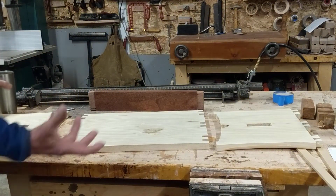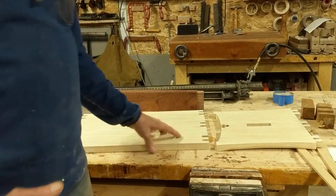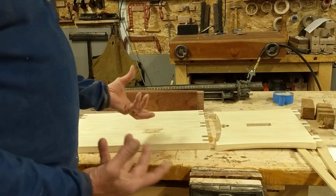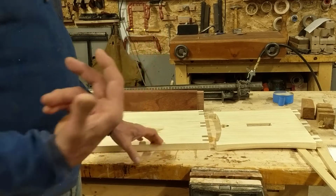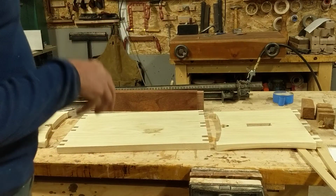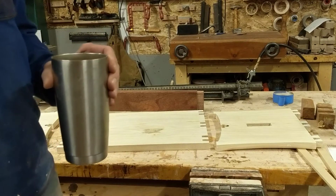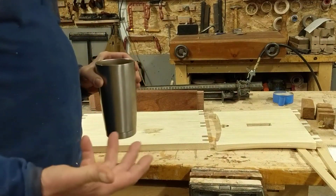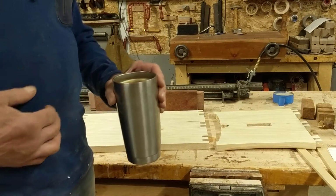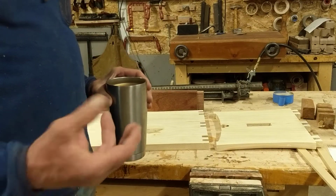And I'm not worried about forcing the glue into the work surface or the wood, the bare wood. This is hackberry. It's a very open pored wood. If I hadn't pre-finished this or not put down glue, if I were to wipe that glue off with a wet rag or something after I got it glued up, I'd force that glue into the open pores. Finish doesn't generally stick to glue. Certainly stains don't. If I were to color this thing in any way, that stain's not going to adhere to that dried glue. Even clear finishes don't necessarily adhere well to dried glue.